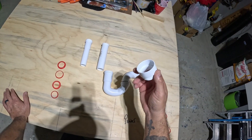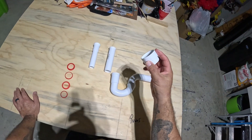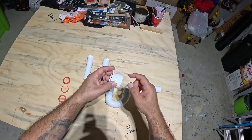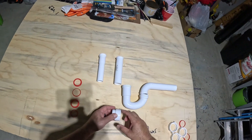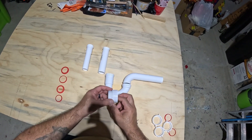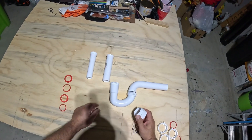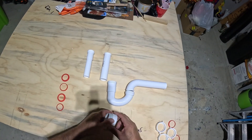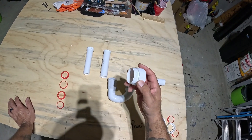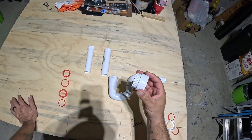In that situation what you're going to see is a trap adapter. So if it's a pipe coming out of the wall at inch and a half, you'll have an inch-and-a-half trap adapter — a glued connection, inch and a half to inch and a half threads for an inch-and-a-half system. Or if you're going with an inch-and-a-quarter system, you need to get a reducing trap adapter that goes from inch and a half to inch and a quarter. That's really where the difficulties come in — the transitions from one size to another.